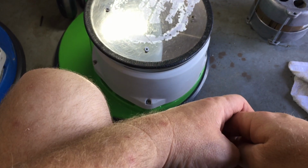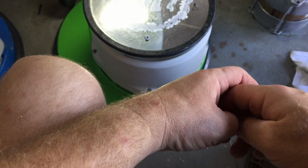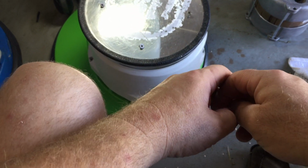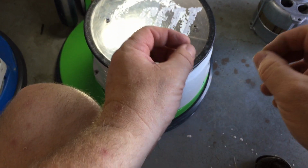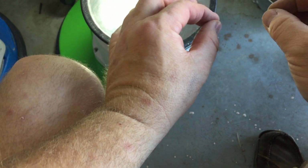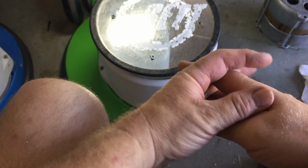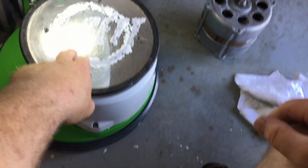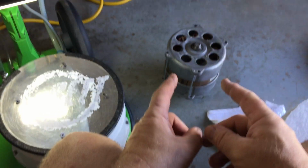Anyway, eventually I had the motor pulled out, and I had it rebuilt, at a cost of about $600 or $700, I think, because there's like a thermal switch in the windings, or it could have been just a winding had burned through, and it was expanding in the heat, making an open circuit, and then it would just quit. I wasn't sure which it was, and the repair guy wasn't completely sure either. But anyway, I had to get it rewound, and that's fine. And that's the motor that's in this machine, which I had rebuilt with that motor in it, that one right there.